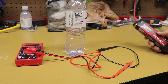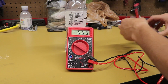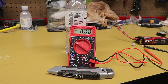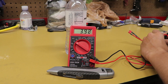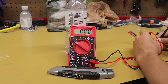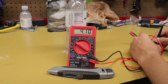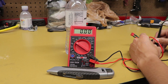First let's go over voltages. We've got a multimeter set up so we can see the voltage. I did charge and use this battery a little bit but not very much, so we should still have a decent amount of power. Let's check the first cell — it's coming up at 3.93. I believe that is the bad cell in this battery pack, but we'll double check and we should be able to visually confirm that once we get the battery open. Cell number two is at 4.11 — 4.1 — so that is correct. That is one of the good cells.